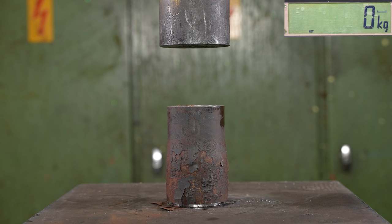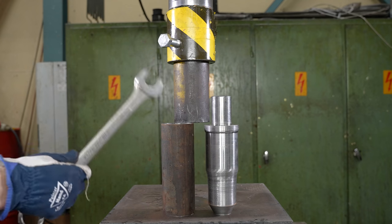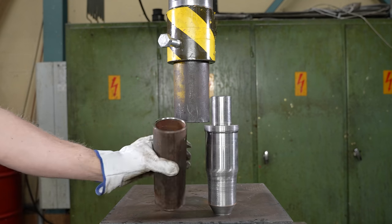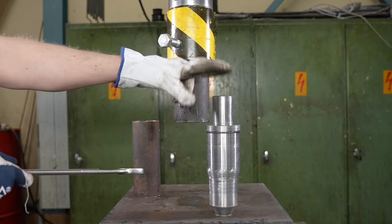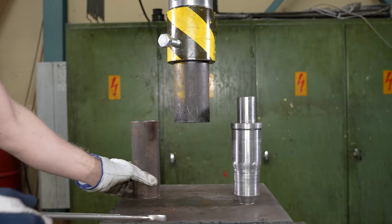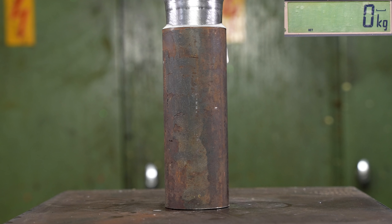How much should we go next? Really hard to say — let's go five... actually, is 10 too much? Let's go 10. Now we have again a 63 millimeter inner diameter pipe and a 73 millimeter rod. I'm going to mount this so we can use a longer length without fear of it buckling or flying out from the press. Twice the stretching as last time — I'm going to say 30 tons.